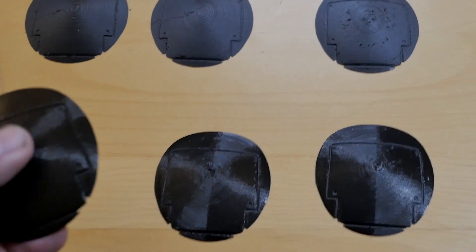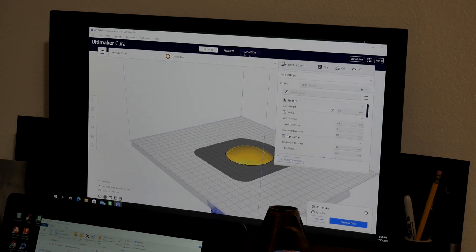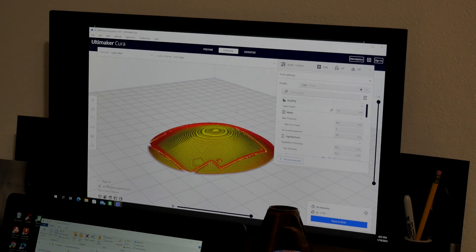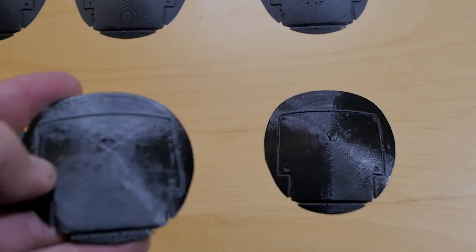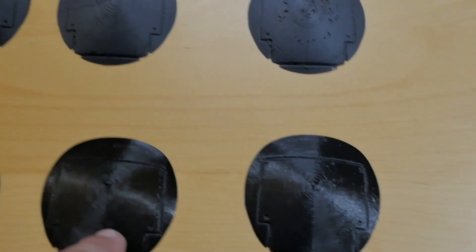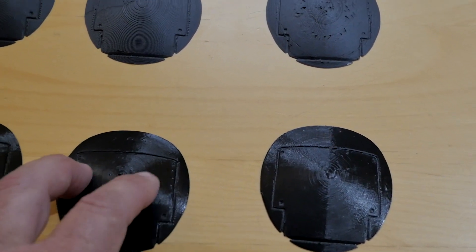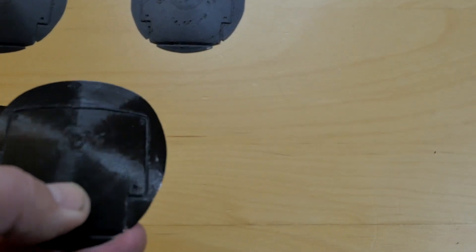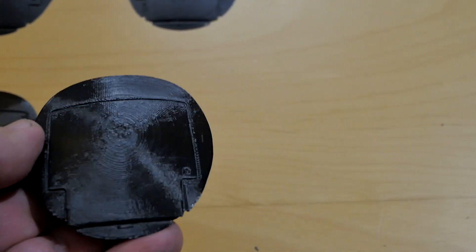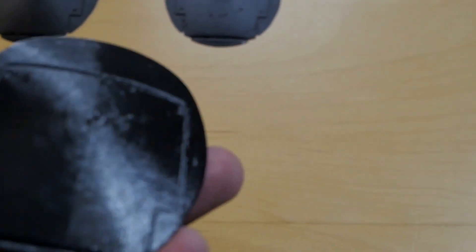This sample set is done on the Anycubic — regular PLA with a really glossy finish. The standard one at 0.2mm shows rings. The 0.2mm with adaptive layers was starting to bubble up too, similar to the carbon fiber issue. Both did well on the outer circumference but at the top they still messed up. The third one at 0.12mm with adaptive layers is still iffy.